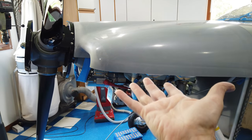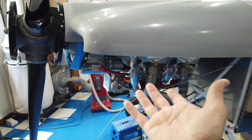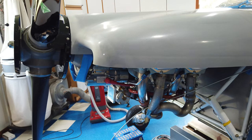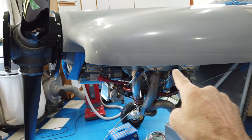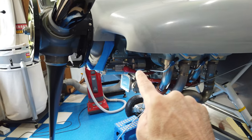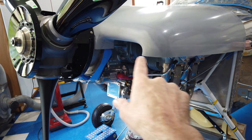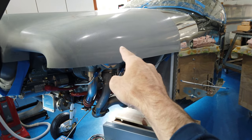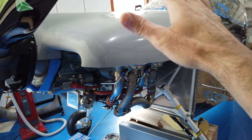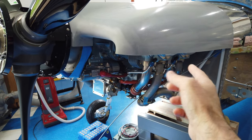Then I can bring up the bottom cowling, get the cutouts for the landing gear legs, and get the bottom cowling in place. With the top part basically attached and the bottom cowling up in place, I can start to pay attention to the interaction line between the top and bottom, and revisit the front area between the two. That way I can kind of do both at once, rather than keep fiddling and then having issues when everything is fitted.